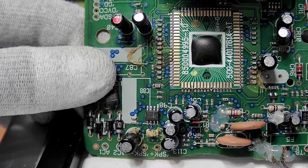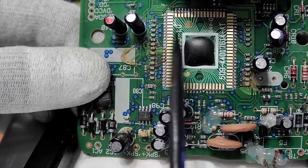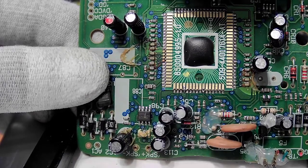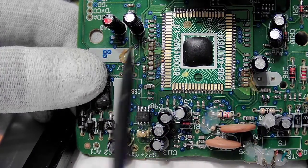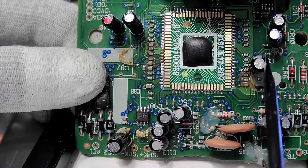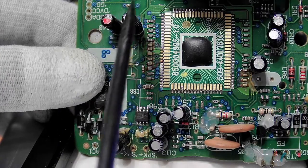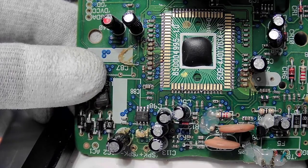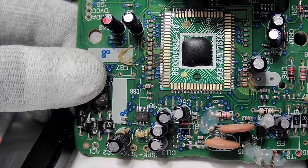Okay, just for the heck of it, I've got a little PCB here that actually has a second little board soldered onto it, and I'm going to try to remove that. And also, it is encased with tiny little capacitors, and there are some electrolytics around it. So I'm going to put a bit of alfoil around the electrolytics, and then we're going to use a thermal camera to see how hot they get after this board might come off. So I'm going to mount it on the rework station now, and we will see what we end up with.